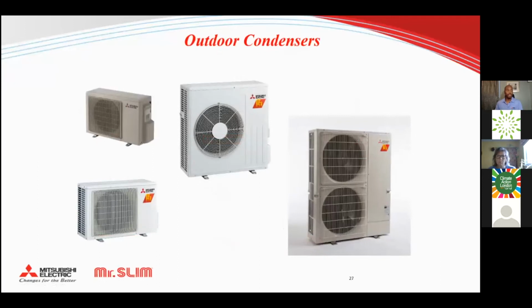And then the outdoor units, again, come in various sizes depending on capacity. They could be a 1-to-1, which means one condenser to one indoor unit, or they could be a multi-split where the condenser serves multiple indoor units. And they can be as small as 22 by 32 or as large as 52 by 42, but they've got a very narrow profile. The max width or depth is about 13 inches. So they sit really nicely beside a house. You can even attach it to the side of the house, and these things are whisper quiet. We're talking about 50 dB, so they could be right under a window, which you definitely couldn't do with your AC system.